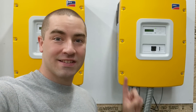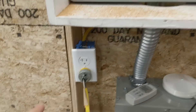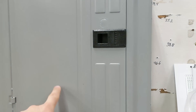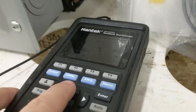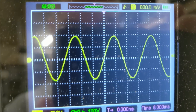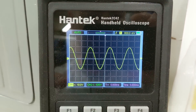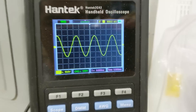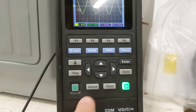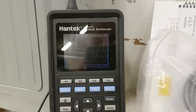What I'm really excited to test is these SMA inverters — let's see how clean their sine wave is. Since we are on the grid right now, these are not powering anything except one outlet dedicated to a circuit breaker panel just for these SMAs. Plugged in the scope and it looks like a pure sine wave. That is great. I'll also need to figure out how to zoom in — this one works differently from the other oscilloscope that had knobs to turn — but at least we get the broad picture.